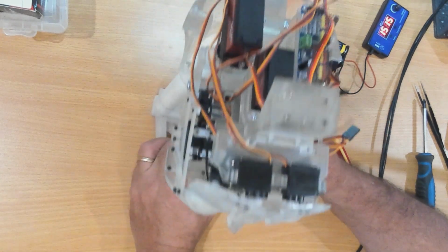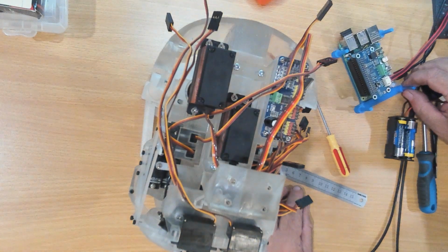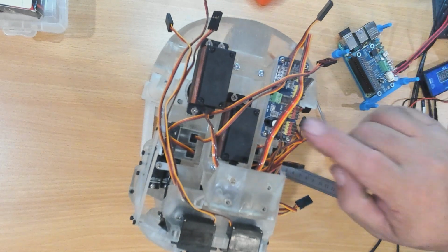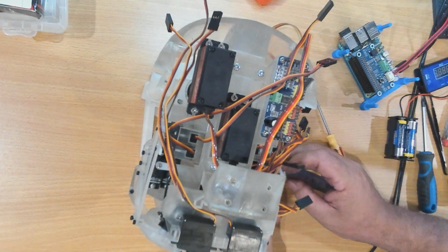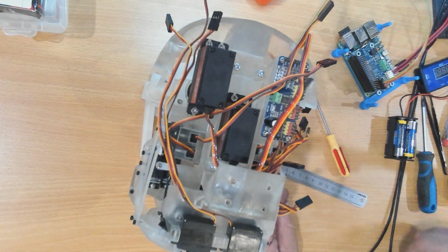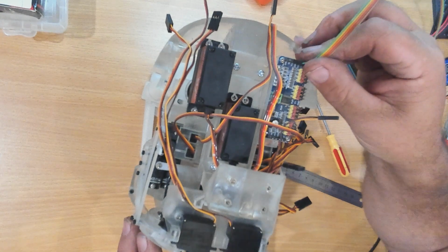So in the next video we will connect up all of our servos to the PCA 9685. We'll connect it to a Raspberry Pi 5 in this case, which is just here. I've actually installed on this Raspberry Pi 5 a Waveshare audio card so that I've got a speaker and microphones, and we'll run My Robot Lab up on this and control our servos through it. I have already made up a cable. This is just a bit of ribbon cable. In this case it has 5 cores, which will plug on to the 5 pins closest to the or furthest from the USB ports, and we will connect that onto our PCA 9685. In fact, in this orientation with my green wire, which is ground, facing this way.